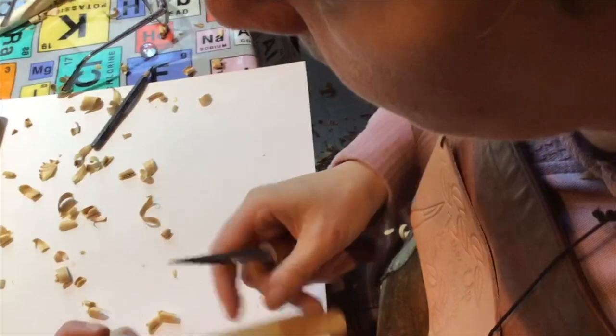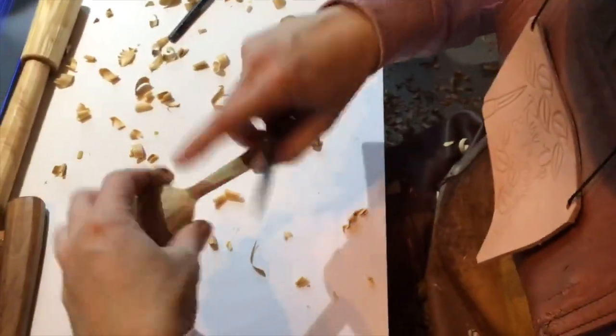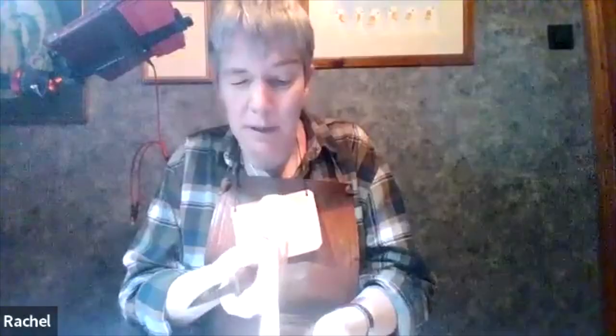And I've put a little chamfer on either side there, because now I'm going to thin the handle even further. I don't know whether you remember, it was 3 mil from the center line either side on that neck. And that's thicker than it needs to be. I can tell because it's nice and strong. So depending on your spoon, now's the time to finesse it, to make it narrower for me, so it's just strong enough.